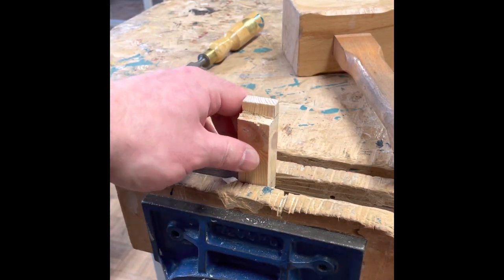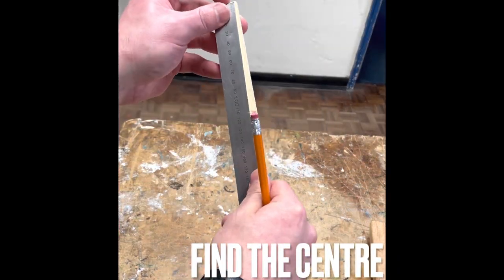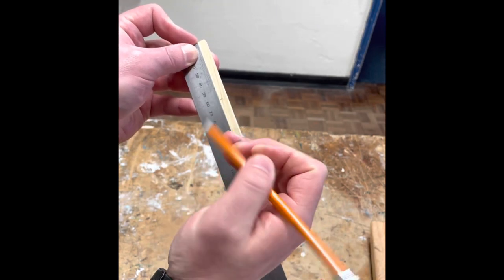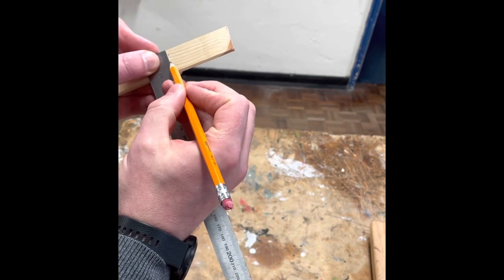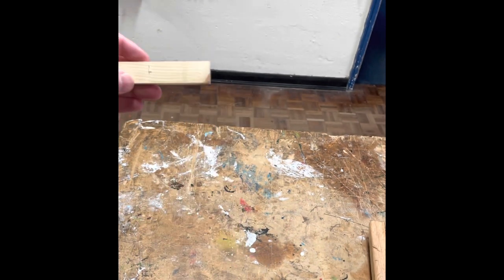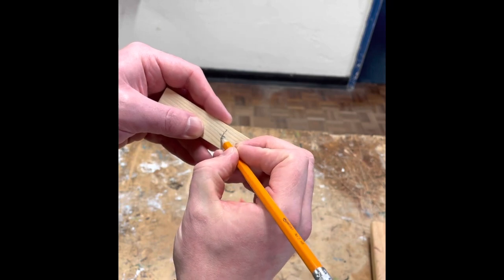Keep testing and trying with your thinner side to make sure that your lap joint is accurate. Once you've done that, take one of the thinner sides, which is going to be the back piece of your light, and find the centre — measure to find halfway both ways to find the very centre. This is going to be the hole for our USB cable to come out the back of your light, so take your time, make sure it's accurate, and mark a cross where you're going to drill through.